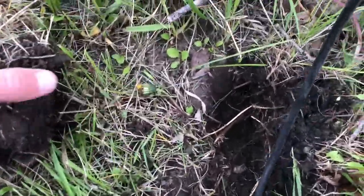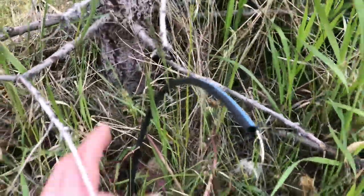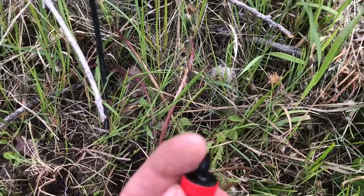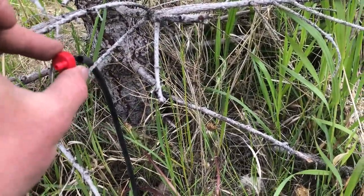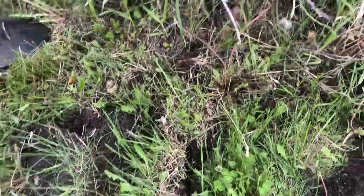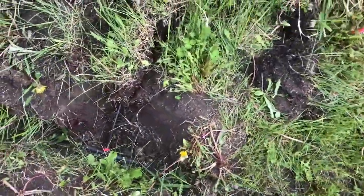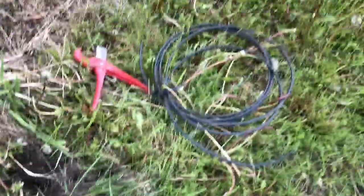Run this piece through, sort of set that on there again, and then this piece comes out of the ground right up there. To finish it off there's another attachment — it's the same piece — so I'll just put that on there. That's it for this part of the drip line. I just attached it in there, ran the line, and then you can follow it around and it's just sitting there at the tree. I leave the end open so that when we turn the line on we can check to make sure it's still attached properly and not leaking. Once the pipe is complete, I just put the grass back on it — it also helps hold it in place. Now I'm on to the next tree.